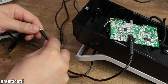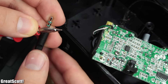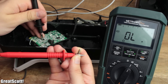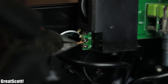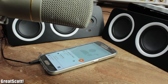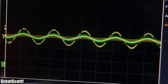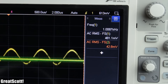Well, not really. Right at the start I noticed that the ground pin of the 3.5mm jack is not connected to the ground potential of the amplifier circuit. So I tried to fix this by using a small piece of wire to connect those reference voltages together. And guess what? It immediately removed all the humming and the music playback from my smartphone finally sounds decent. And without this trick, I would not have been able to record the signals with my oscilloscope in such a manner.